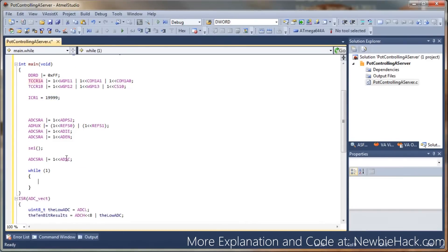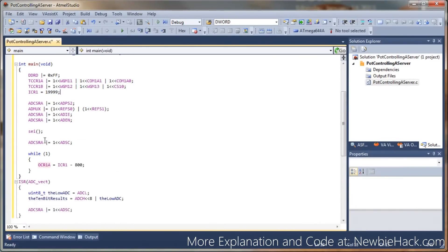The OCR portion I want to be within the while loop. To make the horn move from one extreme to the other, this value has to be either 800 for one extreme and about 2300 for the other extreme. So what we need to do is convert a value from 0 to 1023 to a value from 800 to 2300. We can use the slope-intercept formula to do this, and we can insert the high and low values for horn movement directly in the program and adjust those to get a full rotation on the servo.